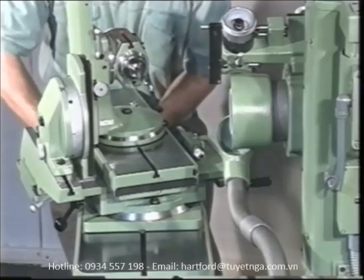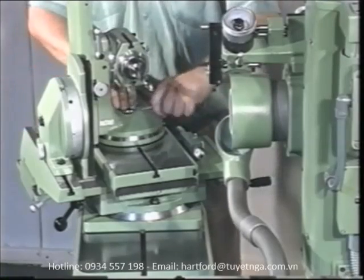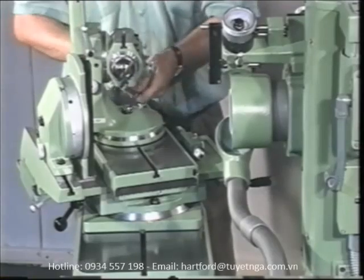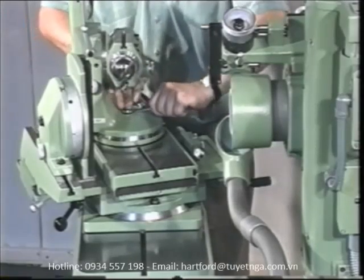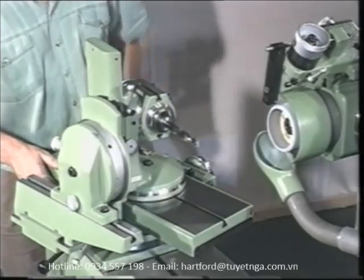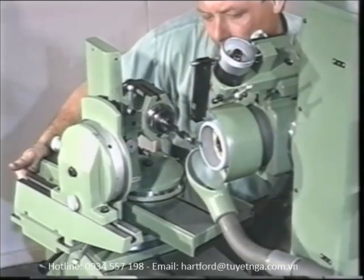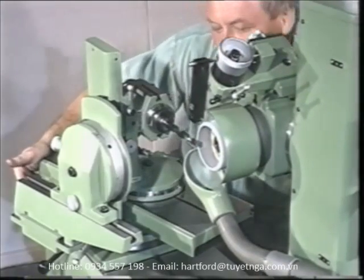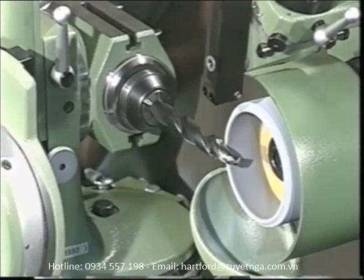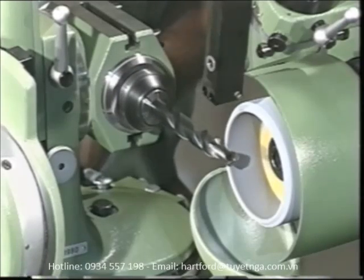For radial axial relief grinding work, the tool slide carrier and index head are swiveled counterwise by the amount of a component angle. The combination of the index head and the spiral and relief grinding attachment then transforms the forward motion into a radial and axial grinding motion. For frequent axial and radial grinding jobs, the S11 can be combined with a special relief slide that permits direct longitudinal and lateral adjustment without interaction.